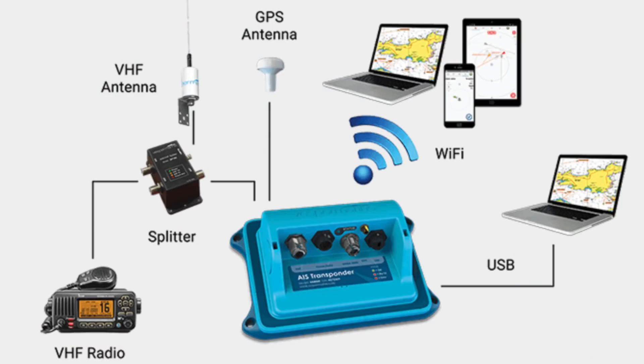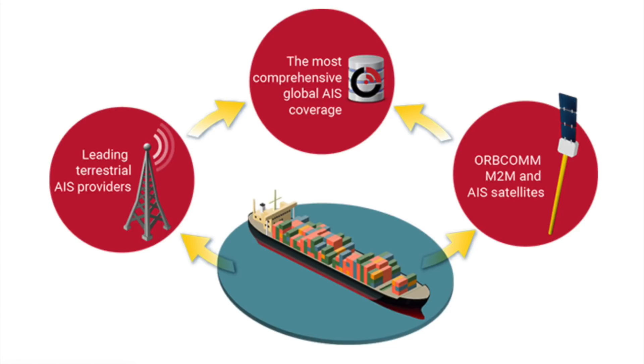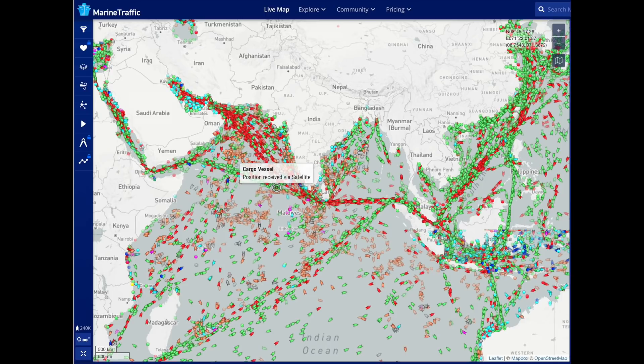While sailing within some countries, AIS is mandatory. So if you don't have it on your boat and you want to circumnavigate, you'll probably need to get it. We really like our Vesper XB8000 with WiFi connection — it's connected to our NMEA 2000 bus and transmits all NMEA 2000 and NMEA 0183 data over WiFi. You get all your NMEA data and AIS data on all your navigation applications. There are also services that pick up all AIS signals around the world via satellite, so you can view marine traffic real time and even find your favorite ship, Aquarius. This is a good photo to have on your computer before a crossing so you'll know exactly where all the shipping lanes are and plan your crossing of them accordingly.